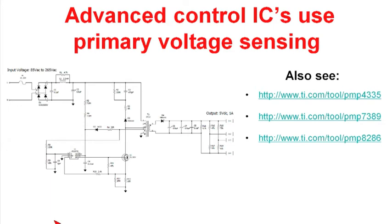Here's one example of a quasi-resonant flyback used in a wall adapter. This is an offline power supply with a universal input of 85 to 265 volts. It has a fairly simple input EMI filter along with a diode bridge. Right here is the power stage — the MOSFET, power transformer, and a snubber on the drain of the MOSFET. You turn the MOSFET on, build up current in the magnetizing inductance, turn it off, and the voltage on the drain flies up. That causes the output diode to be forward biased, delivers energy to the load, then the current in the magnetizing inductance decays to zero, the diode turns off, and the drain rings — and you do your valley switching during that ringing portion of the waveform.